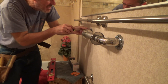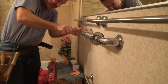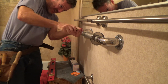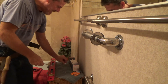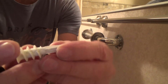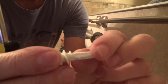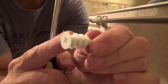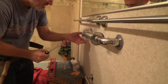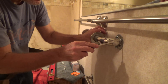I'm going to look at this and make sure I'm lined up, and I'm lined up with that one. I'm not going to snap that one in just yet — I'm going to just kind of get this started. You can see in real time how long it takes to do it by hand. I heard it snap — that's the plastic anchor snapping off. It's designed to do that: when you get your screw in so far, it breaks the plastic off. That's not where you get the holding power — the holding power comes from the threads.